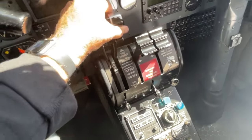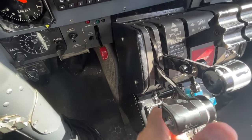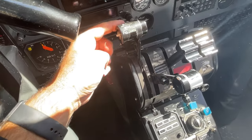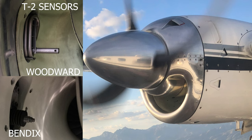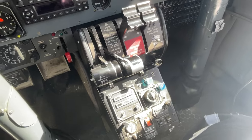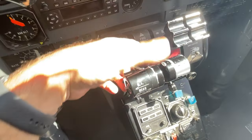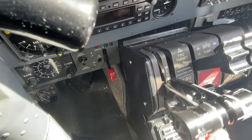Starting the Garrett is a simple process — there are only a few controls that the pilot needs to manipulate. To begin, I'll set the power levers. Power levers move freely from flight idle to forward thrust. To go into ground idle and reverse thrust you must lift up on the levers to cross the gates. There are two types of fuel controllers installed in Commanders: Woodward and Bendix. The start position for the power levers depends on the fuel controller you have. The easiest way to identify your fuel controller is to look inside the engine air inlet at the T2 sensor. Woodward controllers will also have a placard on the power lever quadrant. If you have a Bendix, the power levers are placed at flight idle. If you have a Woodward, the power levers are placed between flight idle and ground idle.